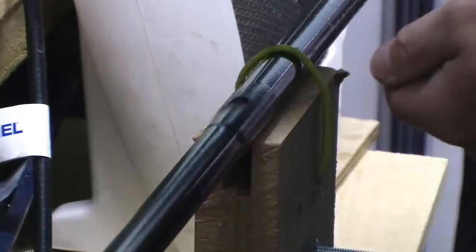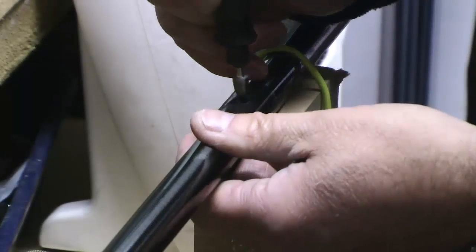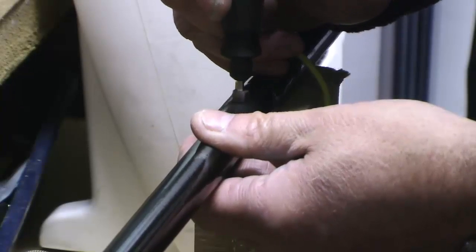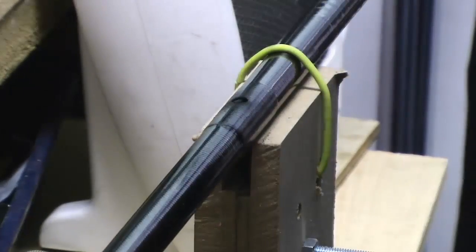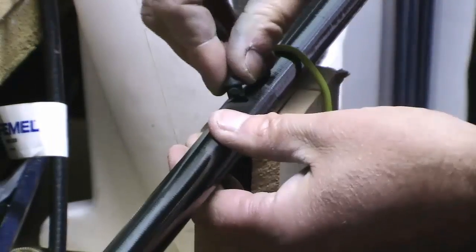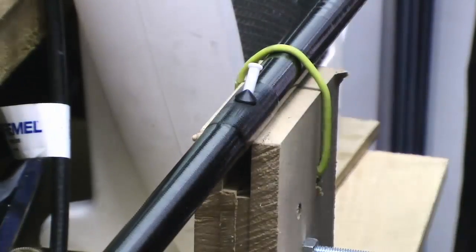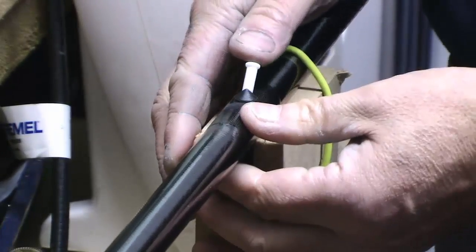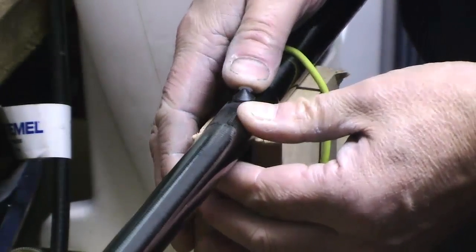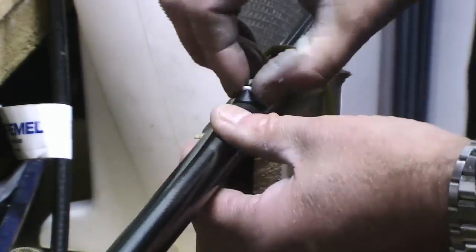Okay, it's almost there now. Almost there. Keep pressing the thing the wrong way. So now, there you go. That seats in. And all you then do, now you've got it seated, is twist it round slightly so it's lined up exactly up the pole, and push the PTFE in. And that is perfectly locked in place. It can't come out.